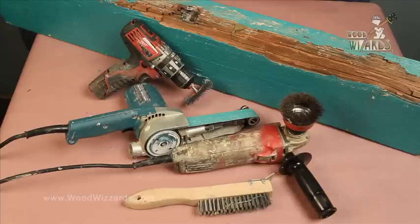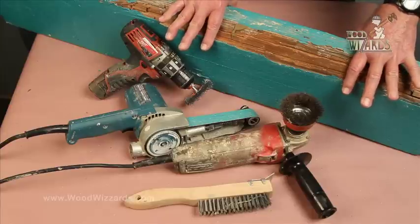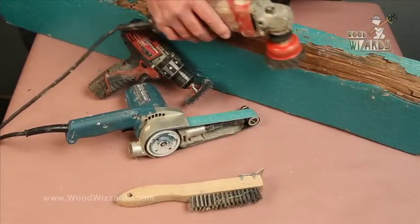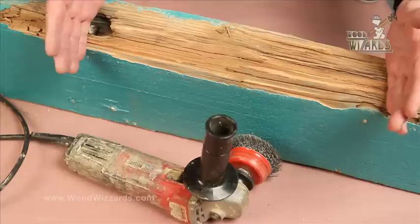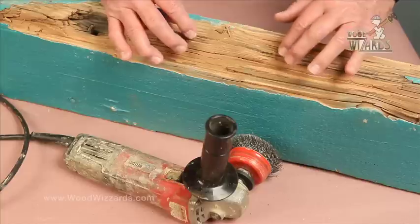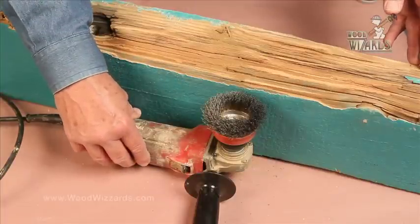And that's how we'll get it before we do the process. We're going to take this wire brush and repair this piece right in the middle to show you what it's all about. We're going to clean out a substantial part of the wood. You've done a great job — we've just cleaned this area. The soft wood has been taken out, the hardwood's remaining, with softened leading edges. This tool is very efficient and quick.